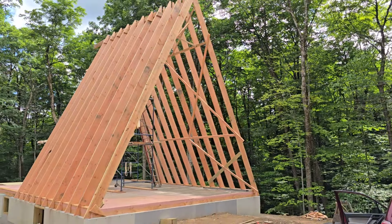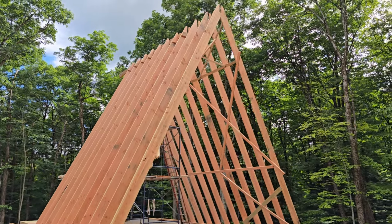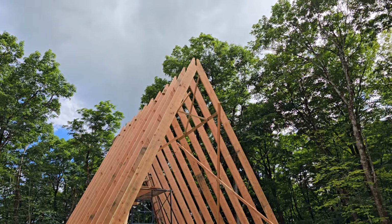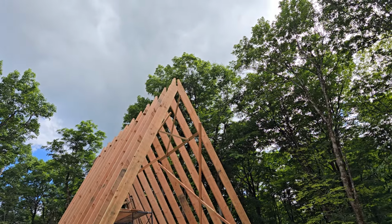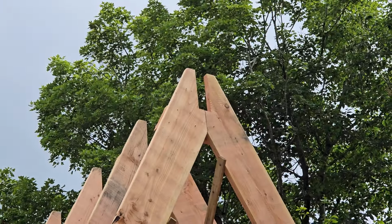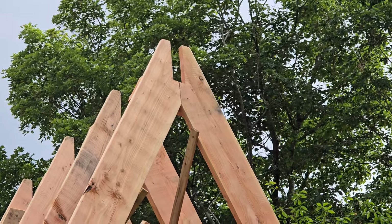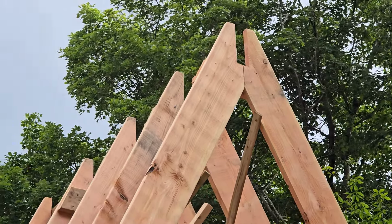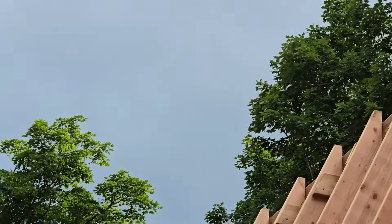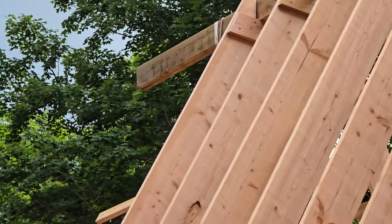They delivered them, and Al and I worked out a nice pattern. We have about 75 years of combined contracting experience. We've done it a long time. So he came up with several innovative ideas. One of which was, you see at the top where those rafters meet, there's a space there, and we actually cut them so that space later would become the place where the ridge goes. We're going to have a double 2x12 ridge, which is extreme overkill, but this whole project is overkill, so we don't want to break the tradition.